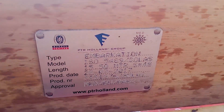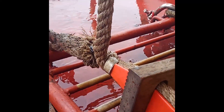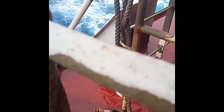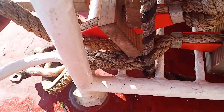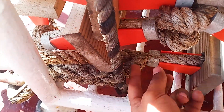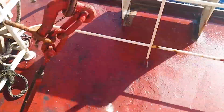We must also check the rope condition at the end of the ladder. At each end the rope is divided into two parts — one connected to the thimble and one loose rope coming out, which is tied off. This has to be checked on both sides — you can see the loose rope coming out from the same end on each side.